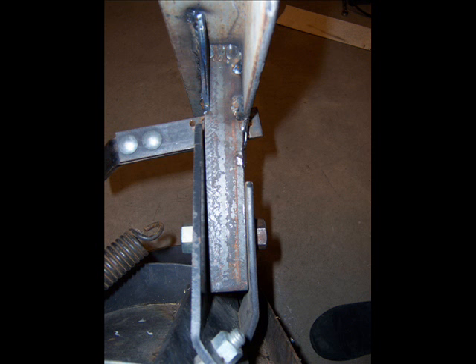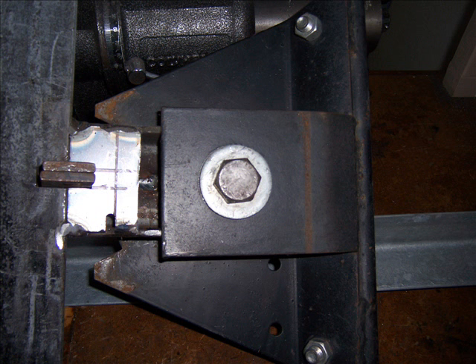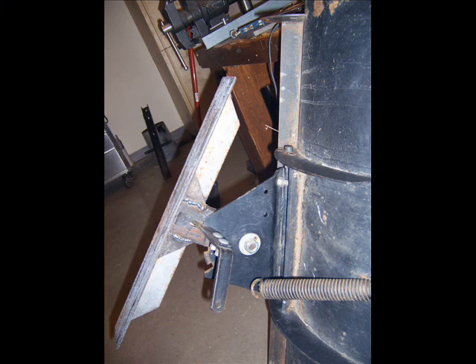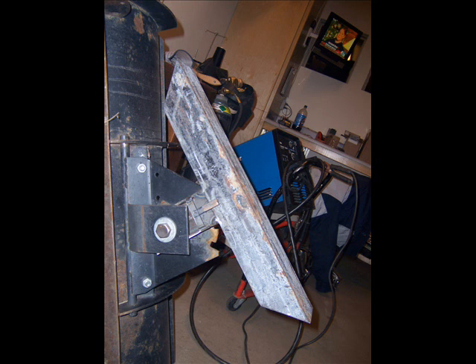What I ended up with was a short piece of channel that I could bolt the blade mount to, and the blade angle lever slipped into the holes and would rotate back and forth. Here's the bottom view of the blade mount and the top view with the gussets made from the 45-degree angles I cut off the end of that big angle iron main mounting bracket. Then I tilted the bracket 45 degrees right and 45 degrees left and made sure that the clearances were okay — I also did this once it was on the tractor.